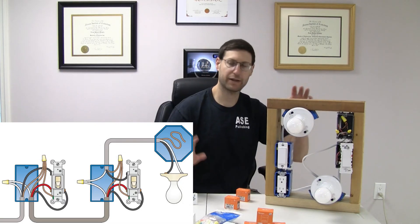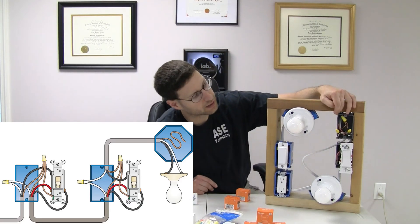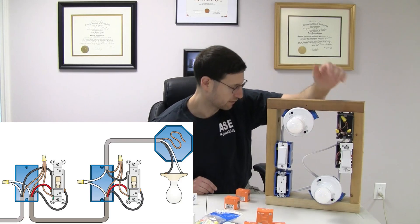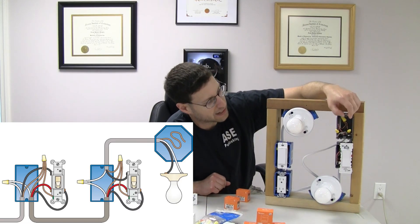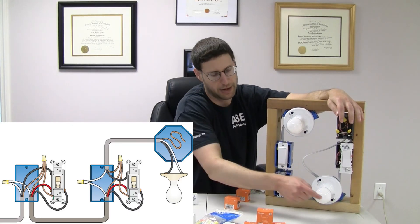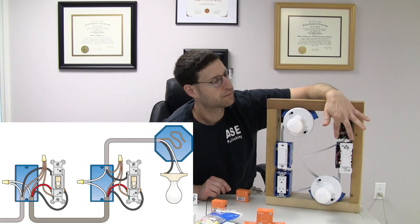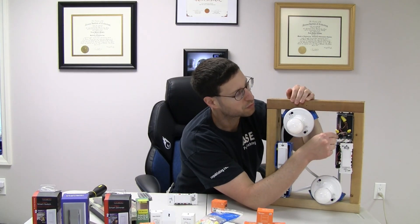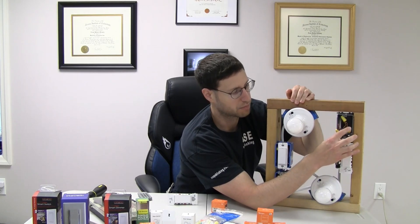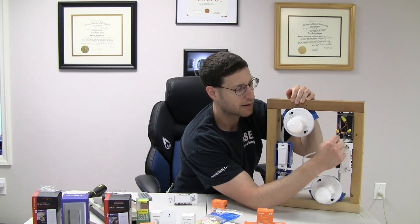So if you see, this is very analogous to what I have right here. I have the mains power going into here, and that's these two capped lines right here. Let me just make sure this thing's off — it is off. So you have these two capped lines right here, and then it goes through a three-way switch and then back down to the load itself. This black line, this red line, and this neutral line — the white line — all run to this box right here. What we're going to do is we're going to take the neutral and the black and actually just directly hook them up to the line and the neutral coming from the mains, and we're going to pump it down to here.